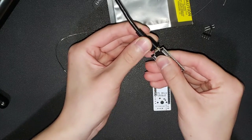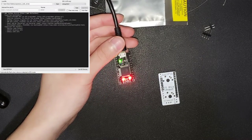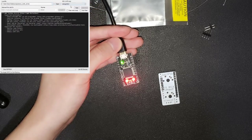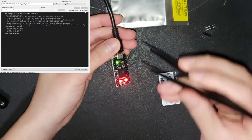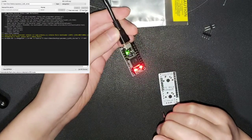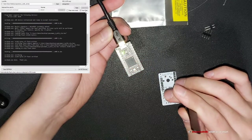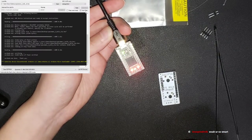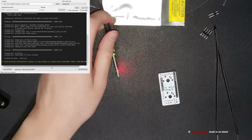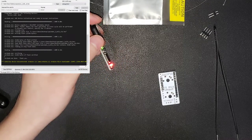Do y'all need to see the process? Okay. It's lit up. Gonna open QMK Toolbox. I want this to be VIA compatible, so I simply downloaded the VIA hex file from Can I Use VIA and stored it. I'm just gonna do auto flash. So once it detects my flashing of this, it'll automatically go. Here's the chip, writing, okay, awesome, and that's it. Now it says it's done, it's complete, and now if I go into VIA, it should... I had to unplug my other computer, but yes, okay.